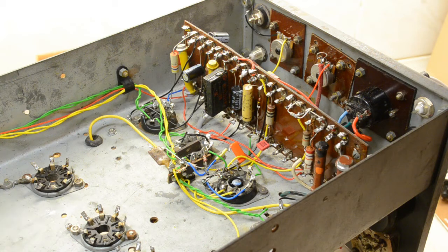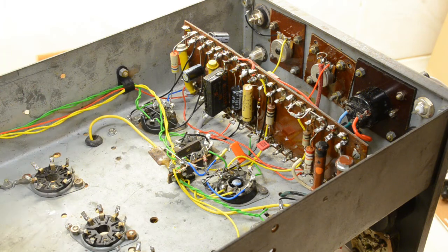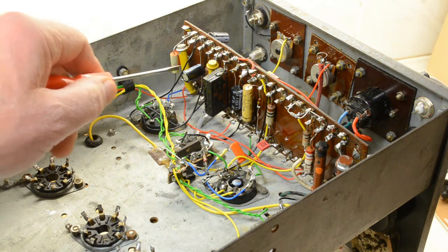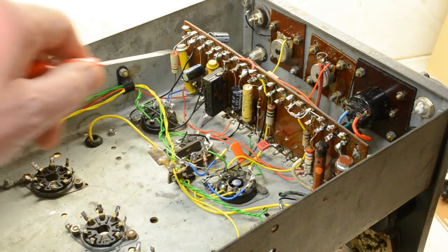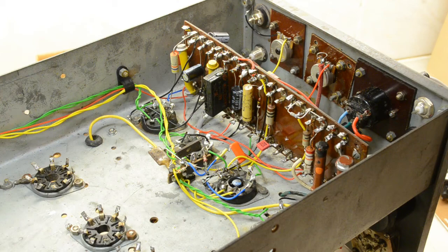or any components. The wiring for this, you'll notice, because this is an old chassis to be restored, I'm trying to use older components if possible. So obviously after checking the values of these resistors, they're within spec, and the capacitors are fine for leakage, etc. That's why it looks quite old on there. Obviously you spot new components here and there. That's where we've had to put new ones in.